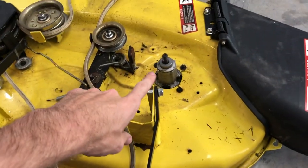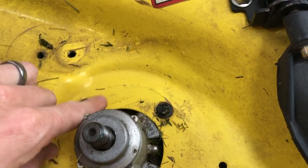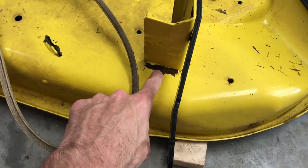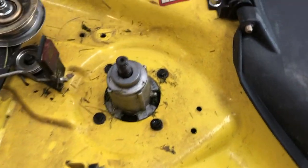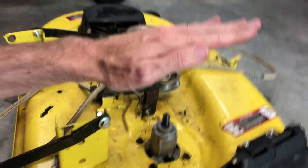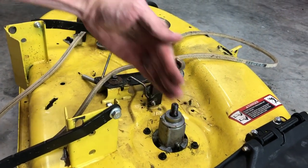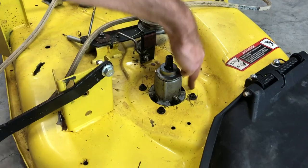I've got the pulley removed off the top side, and if we look up here, you can see a crack through the paint — there's definitely some flexing. There's also back here at the back of the deck some paint chipped off, and that's usually caused by some flex that happened, maybe hitting a tree root or hitting a curb. Right now the blade is sitting like this, so the whole front side is pushed up and we need to get it pushed back down. I'm going to turn the blade side to side, support the back with some blocks of wood, and use another block of wood and a hammer to try to drive that down.